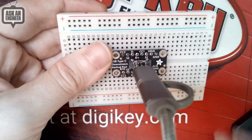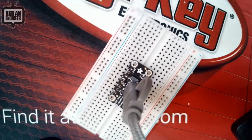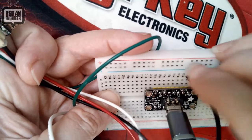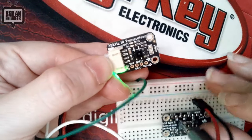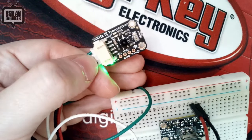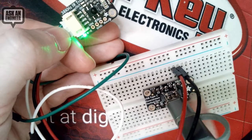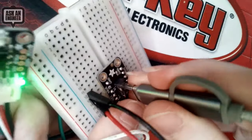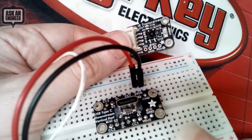So by default, like I was just showing with the IR breakout board, this is just connected to a USB power supply. I can connect this up and it's instantly powered because I don't have power delivery, so I get the voltage out. Some USB-C power supplies will not do it unless you have the resistors, so those are handy. And, nice vertical style. A nice strong connector too. I picked a good one. Sorry, Liz picked a good one.